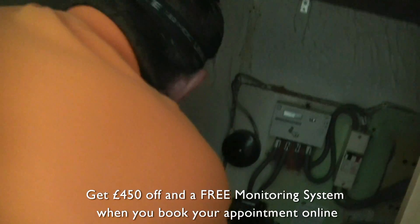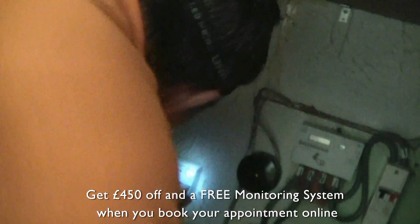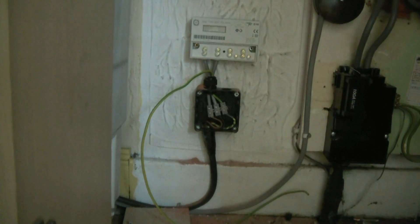With all the panels now connected, we proceed to install the generation meter within close proximity of the current main consumer unit. This meter will provide exactly how much energy is produced from the panels for that particular day. There is also a portable monitoring system available. For electrical safety measures, to comply with regulations, an isolation switch must be installed in this area.